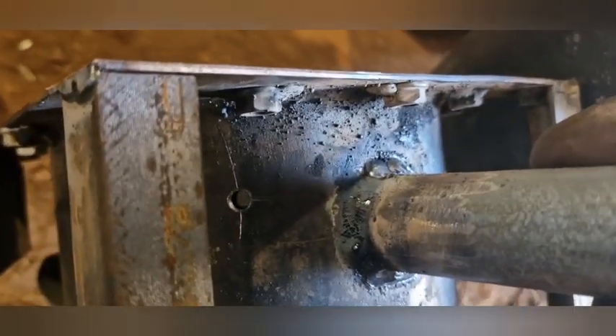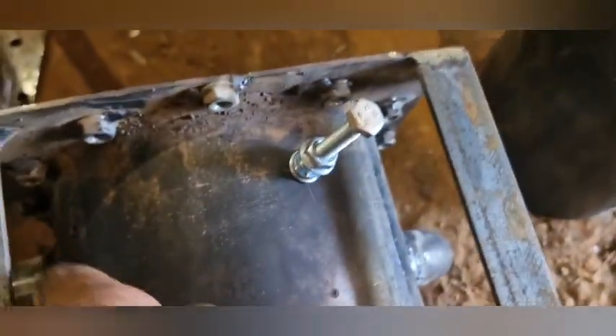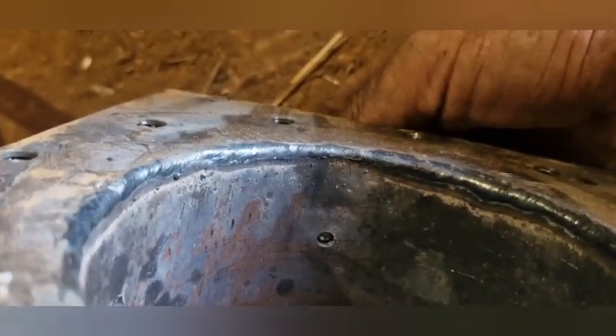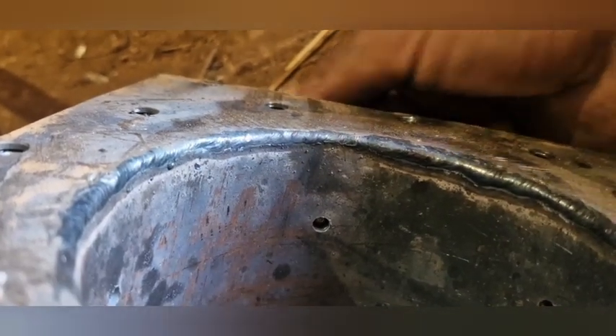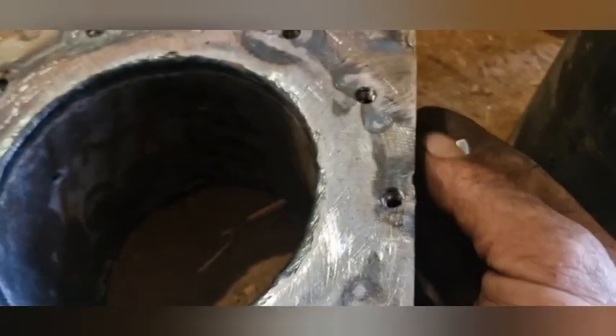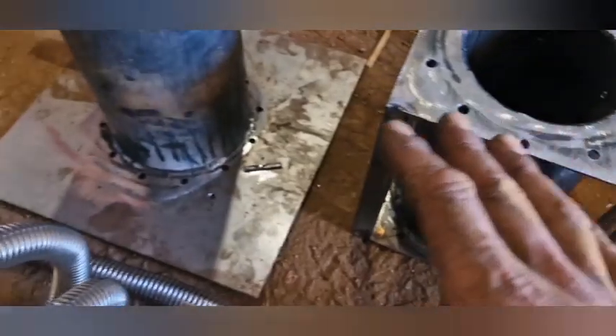For each stage I've added some inspection ports going inside, and nozzles or holes that go through and through — I've threaded them so I can put a bolt inside and close it off. You can open them up to tune the airflow in the two stages up and down, depending on the fuel moisture and how much exhaust gas you need. You can also plug them, drill them bigger — you can now access them, which is pretty useful.